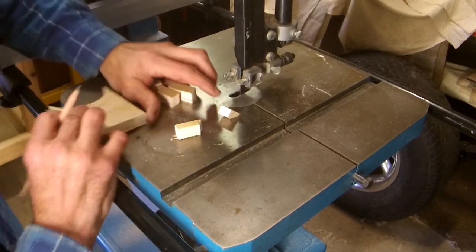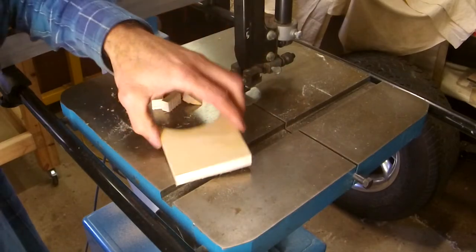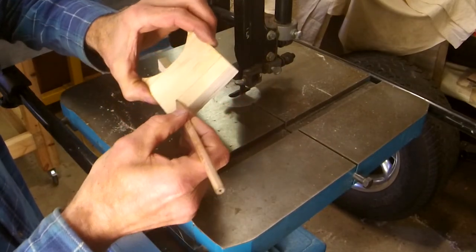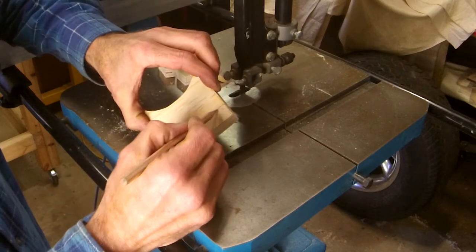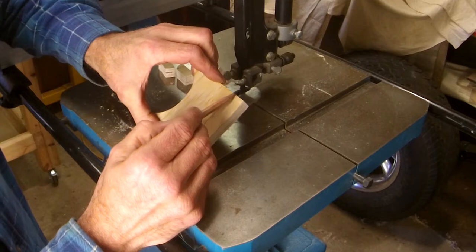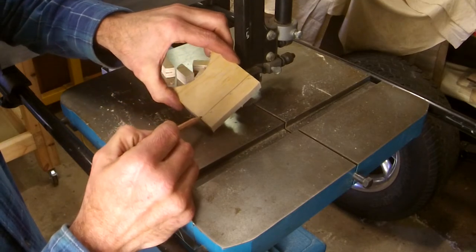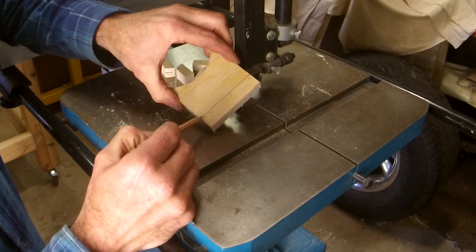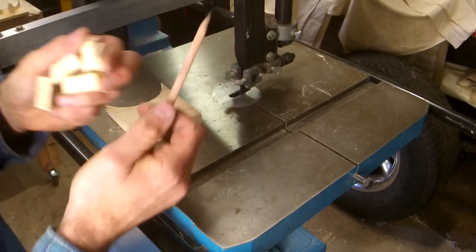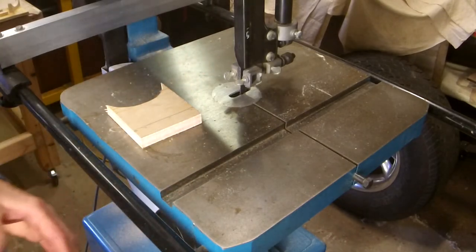My next hot tip. Sorry, just getting rid of my earmuffs. My next hot tip is, I don't know if you noticed, what I like to do, because it looks after our bandsaw blades as well, is when I first start, I'm really cautious to ease into it. I'll travel like normal and I'll ease out of it. In particular, ease out, because the bandsaw blade kind of pops a little bit. So take note of that one. We'll do it right now.